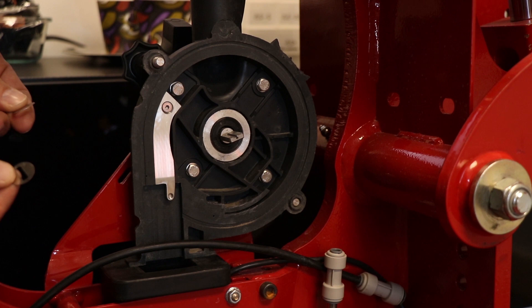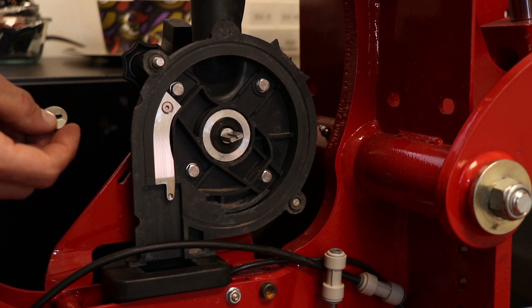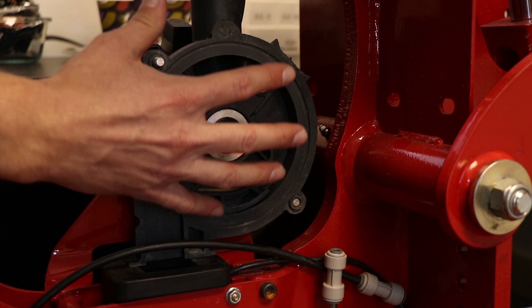The next component of the meter would be your shims. If you're drawing a high amp warning, you're going to want to add a shim or two. Generally not more than four shims are used in the meter itself. If you're still drawing high amp warnings, you may have other issues like buildup of debris around the disc that's causing your disc to spin really hard.